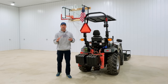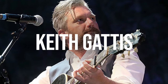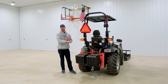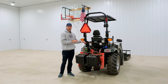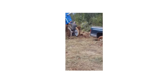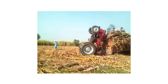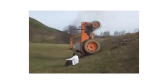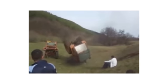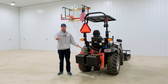It doesn't matter your status in life — this can happen to anybody. The first person who recently died in a tractor accident was Keith Gattis, a Nashville songwriter and singer. He was pulling stumps with his tractor and tied off above the rear axle point. If you go above the rear axle when tied off to something, the tires keep turning, the front of the tractor comes up, and it tips over on you. You need to tie off below that axle when yanking on a stump. That's what happened, and it's worth mentioning again: pay attention to your tie-off point, otherwise you could have a rollover accident very easily.